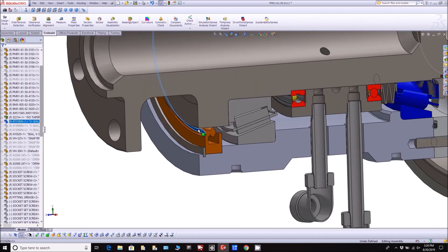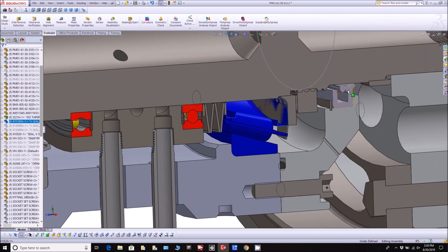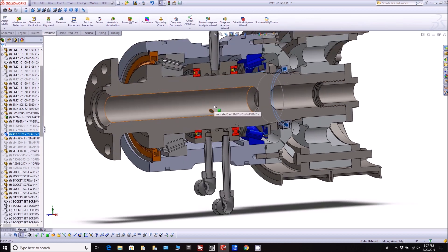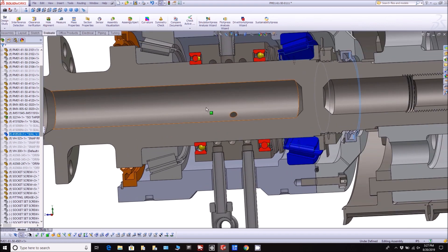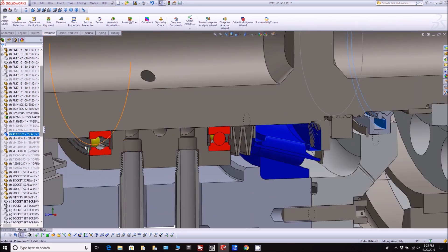Those two holes will be welded up, including the other old one, so there are kind of two and a half holes — two larger and one smaller — that he's going to weld up. The oil will be at a level that can run through that large bearing and down to where the oil seal is, so I had to buy a new oil seal for that as well. Every time you take the old one out you basically have to destroy it to remove it, so I've ordered a new one. The one at the other end was compromised anyway from a long time ago because it's never had oil against it, so I've ordered a new one of those too and it'll be here later in the week.